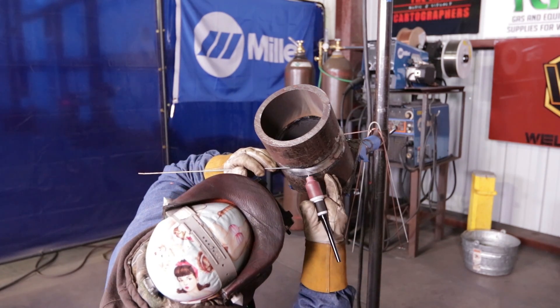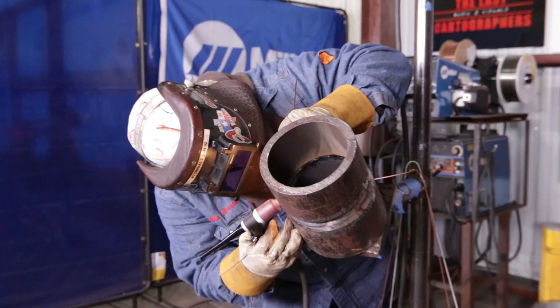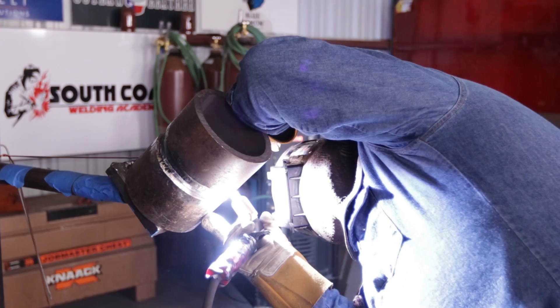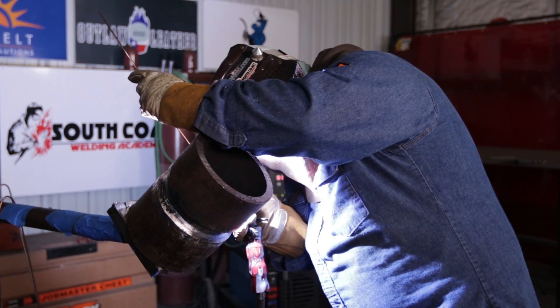Now we're going to start the hot pass. On the hot pass I'm going to free hand it, burning at 150 amps. I'm going to keep that rod connected to the puddle so I won't risk getting sucked back on my root. As long as I keep that rod shoved in there to the puddle and keep it connected, you don't have to worry about the tungsten pulling filler metal from your root. Just a simple up and down, connecting the wall just like you did with your root pass. A sharp tungsten and clean filler wire is always best when starting out.